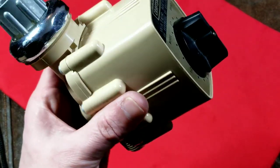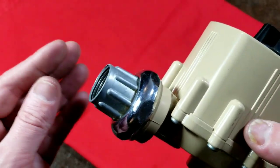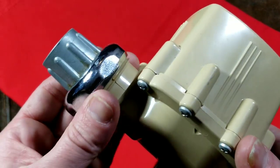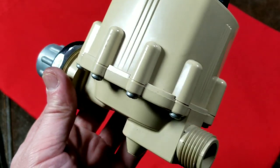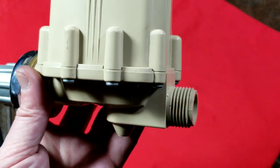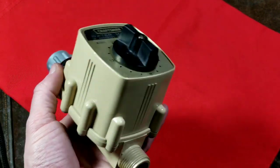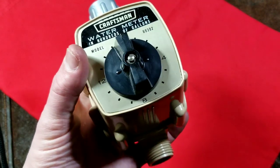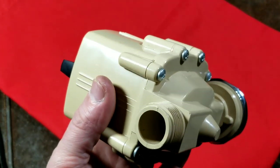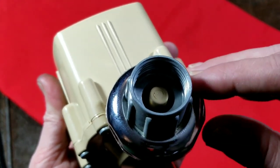This is just set up to run off a garden hose - you take one end of a garden hose and just screw it into this side. It has an adapter so it can accept larger hoses, and on the other side is still the same standard garden hose connector. You put the other end of the hose on and then pump whatever you need through it. It just has a vane mechanism inside. This thing is definitely pretty reliable. The one caveat is they don't include a filter.